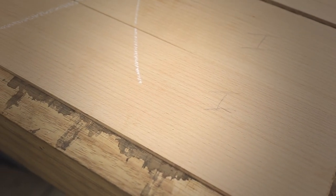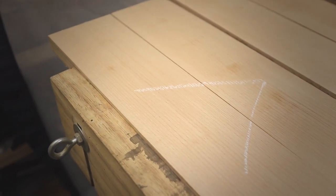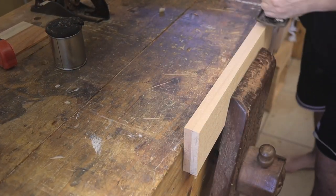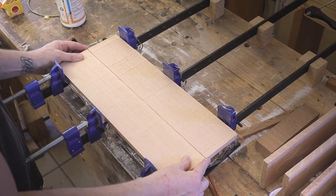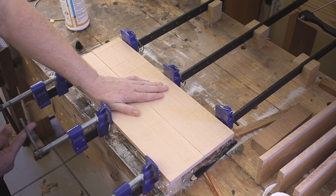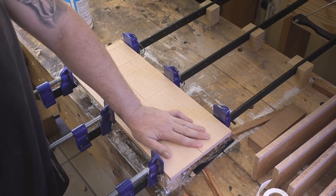Here are the main pieces for the chest done and corrected. However, to get the final dimensions of the chest I'm going to have to glue each board together. For each two boards that need to be jointed together, I'm basically planing them side by side to make a good and exact fit. Then it's time to glue up each piece — I'm using plastic just in case there's glue squeeze-out so it doesn't affect the bars or clamp to the bars at the end of the day.